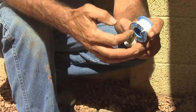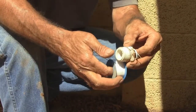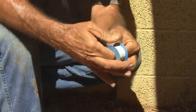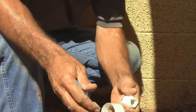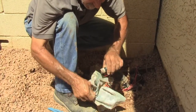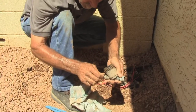Now I'm going to go ahead and Teflon this up. Usually the rule of thumb is always give it 5 rolls — I always give it 6 just for an extra precaution, and it should seal right up. Make sure your other pieces are also Tefloned and cleaned up, because they will also leak if you don't.